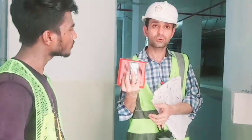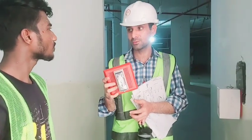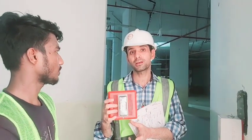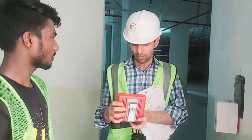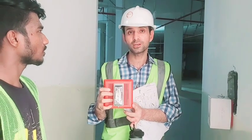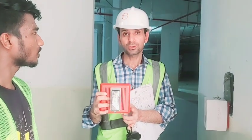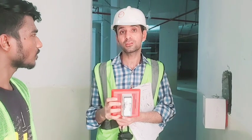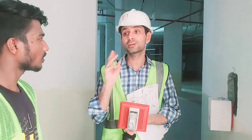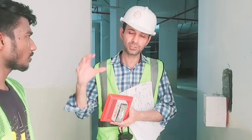I am using BPS — Booster Power Supply — and APS — Auxiliary Power Supply. There is a battery power supply with a 6 ampere battery. We have 12 volts, so the speaker works. The BPS is a booster power supply that gives our flasher a signal. One BPS controls 3 zones, and in one zone there will be 7 to 8 devices.